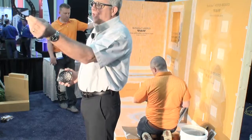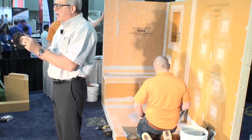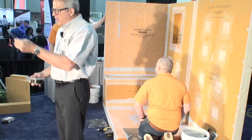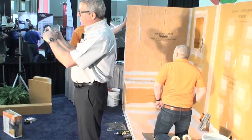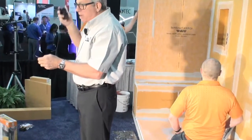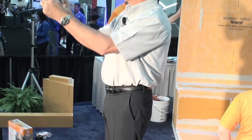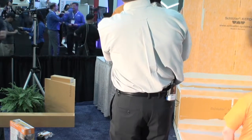And then here's our lateral adjustment ring that fits on with friction onto that collar. You'll notice there's 2 trapezoids that are elongated and longer than the rest. Those are there because they'll line up with the screws for access into the shower, and those screws pop out the back a little bit. So if you're going to bottom this thing out, in other words, if you're going to use a really thin mosaic, you're going to want those 2 elongated trapezoids to line straight up with the screws on this system